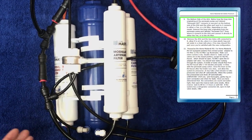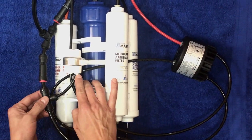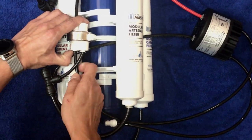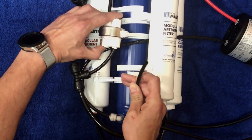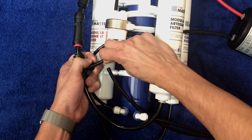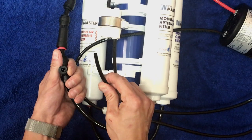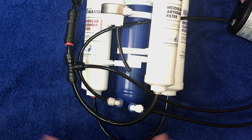On the bottom side of your ASV, you'll notice a long tube running to the permeate pump and a shorter tube running to a T or UV filter, depending on which Home Master model you have. Remove the tube from the permeate pump to the ASV first — push the collet ring in while simultaneously pulling the tube in the opposite direction. Now remove the shorter piece from the T — push the collet ring in and pull the tube in the opposite direction; it should release very easily. Lastly, take the tube from the pump and connect it directly into the open T. Your ASV is now free and clear.